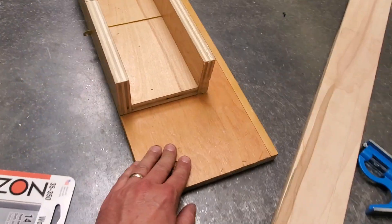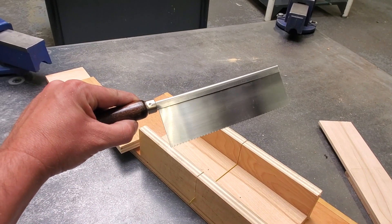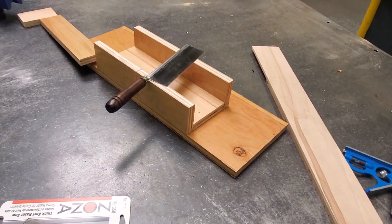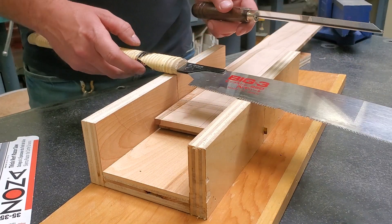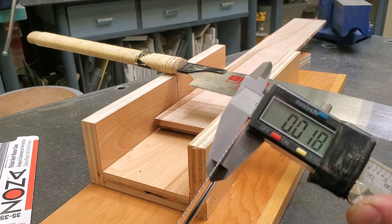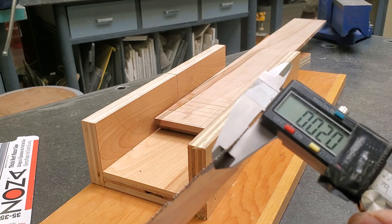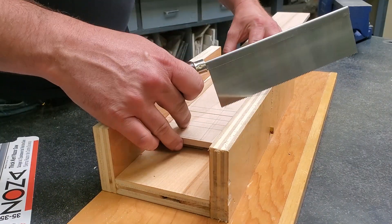I had another piece here so I can clamp it to the edge of a table — maybe I'll add some sandpaper for grip underneath. I'll probably invest in a longer saw; the width is right and it's sharp, but it's not quite long enough for the size of this miter box, so I don't get a whole lot of throw. This is my first one, so I know I'll make more prototypes. I've ordered a better one from a friend — measuring the kerf: 0.018 to 0.020 inches, not a massive difference, and both should work well for the frets I'm installing.